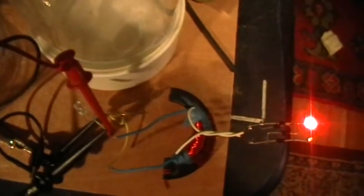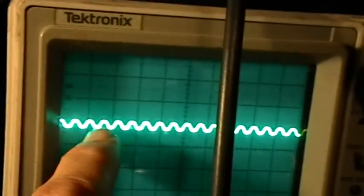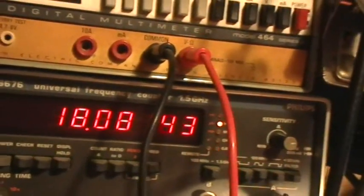So let's keep going in frequency. Now it went out. Now it's starting to come on really bright. Right about there, where that output LED is really bright, the input LED is totally off. We have a shrinkage in the amplitude of the waveform and it starts showing some of that distorted wave shape. So let's note a frequency of 18.08 kHz.